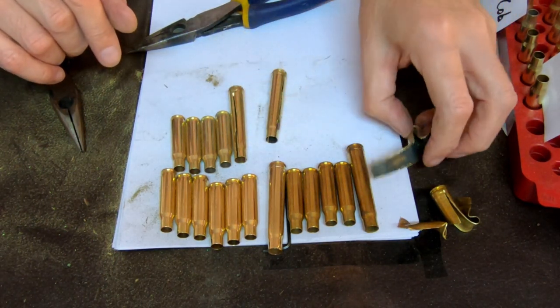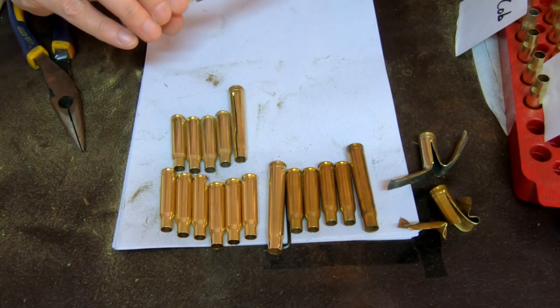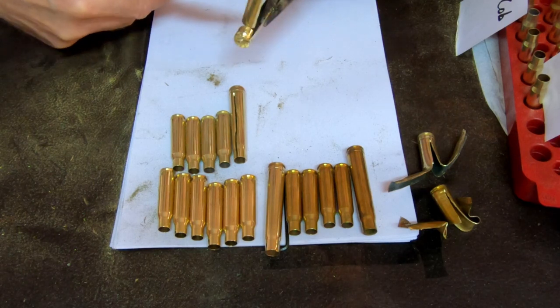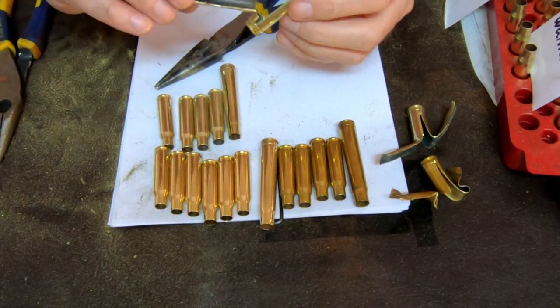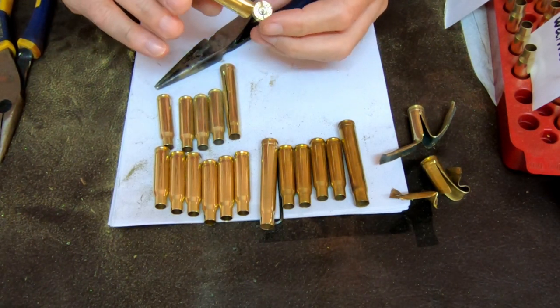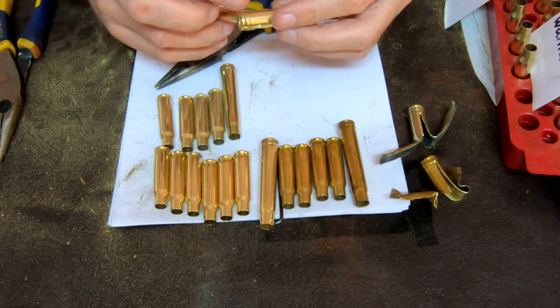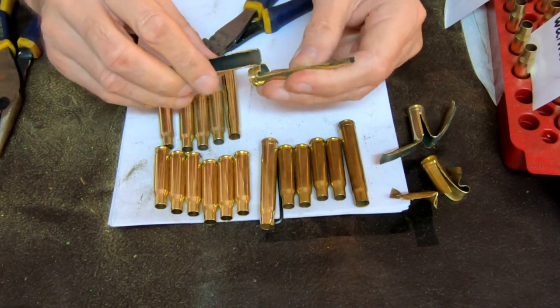Now let's go and have a look at the one that came out of the crushed walnut. So let's have a look at that one. We also use some force to get this one open. Okay, this is the crushed walnut one that I've just opened up, and what I thought would happen is exactly that, and that is the case that had some appearance of head separation. So when I bend it open now, it came completely off at that part of the head separation.